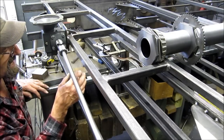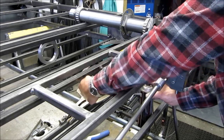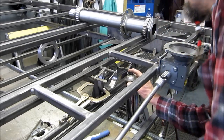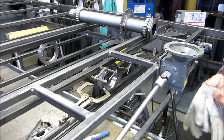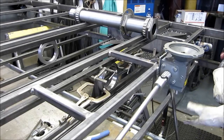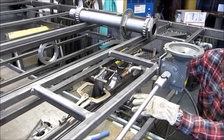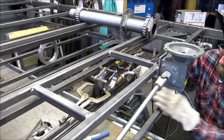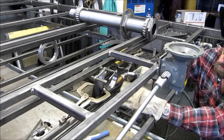We'll use the same three tape measures on the next one as well. Let's weld it in there. We're tacking in from the side, which shouldn't be in line with the bearing — this is a bare bearing race. We're going to coat it with anti-splatter so we don't get any splatter sticking to the race. It's not good on the bearing. If we accidentally do, we'll use scotch brite to clear it — this isn't a high-speed bearing, so even slight damage won't prevent good turning if we get rid of the high spot. We're putting four tacks in here and will probably do the finished welding heli arc on the other side.